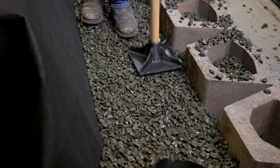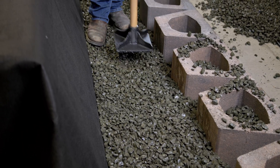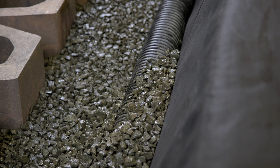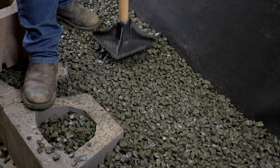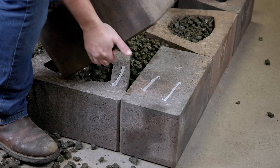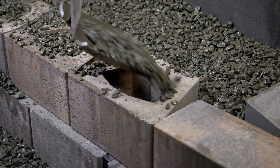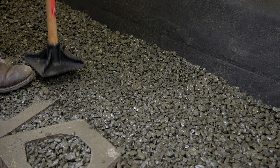Another key addition to the drain system behind a retaining wall is going to be a compacted gravel backfill. What this does is it creates weight behind a retaining wall to help tie it into that hill or whatever it's retaining to create more structure. On top of that, when you use something like a three-quarter inch crushed clear open rock, you also add extra drainage to relieve excess moisture and not retain it in your soil. What you typically would do is excavate for a retaining wall, put your base construction in there, then as you stack your wall blocks, add three-quarter inch or one inch open clear crushed gravel behind it in four inch lifts, and hand tamp or compact that to acquire optimal compaction.